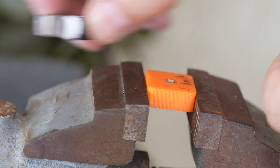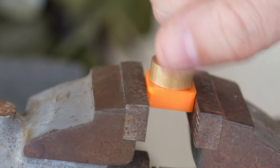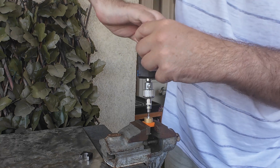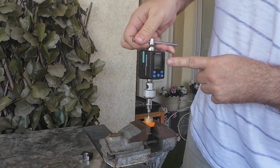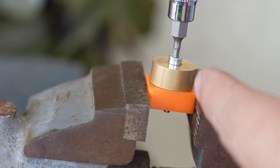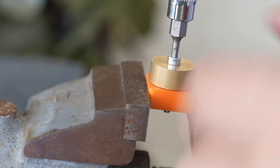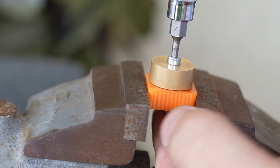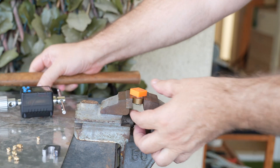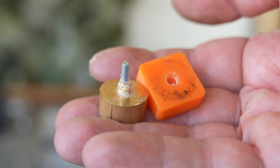This cylinder will be the object pressing against the brass insert. I start rotating and I would normally stop here — but oops, it just broke at 2.4 newton meters. And I noticed I cannot unscrew it afterward — the brass insert and the part are screwed together so tightly that without holding the brass insert I cannot remove it; I would have to cut it. For M3 this is super tight. Just as a reminder, the maximum torque for M3 bolts is approximately 1.2 newton meters — depending on materials, you shouldn't go above 1 newton meter in most cases.